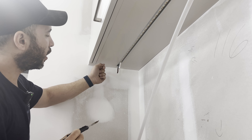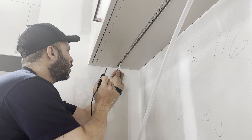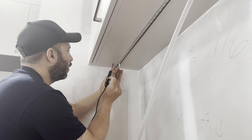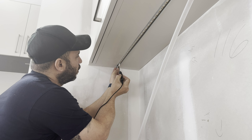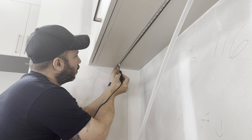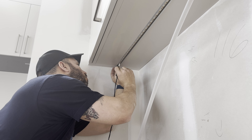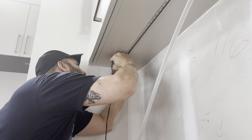The reason we do that is now when we press it against the tape light and solder it — it's such a small situation, there's not a lot of space — it will adhere to the small amount of solder we put on the actual tape light. It will make our connection process easier, and since we have this basically floating here, we want to make sure it adheres and cools down fast so we have a solid connection.